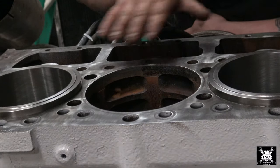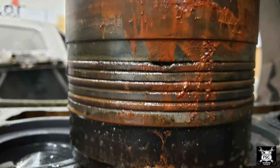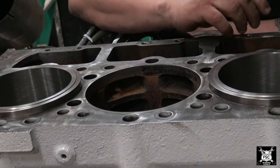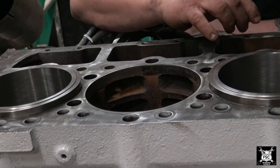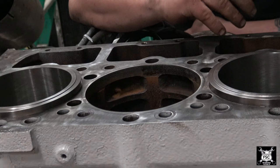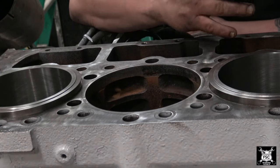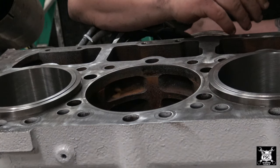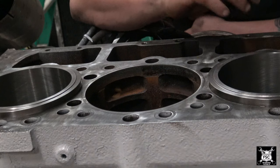Now this has already been done in the past. Now this is not something that water would have chewed away like it did with the O-rings for the liners, which is why I think it failed. However, I do need to check that these shims are the proper size and work with this job. So now you see what they do when they counterbore the block. I've never counterbored one before. It might be best that you have someone else do it, or maybe you do it yourself. You know what you're good at. Hopefully I won't have to do anything other than change these shims, if even that.